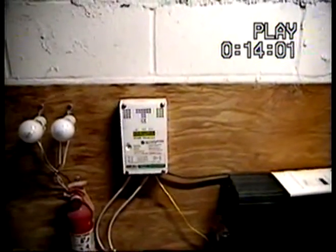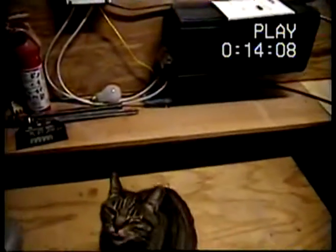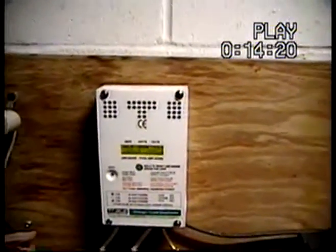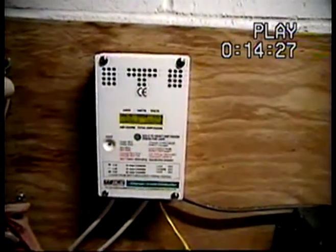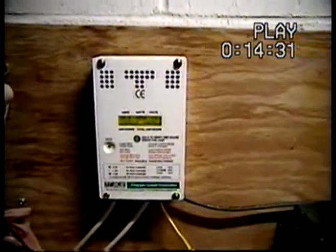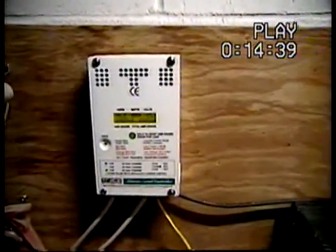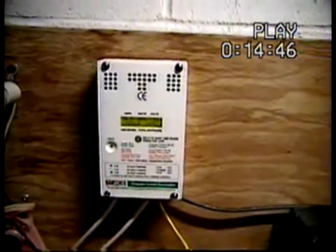It's still kind of early — around 10:30 — and we've got a lot of trees. It's wintertime, a few days after Christmas, and the trees are in the neighbor's yard so I can't really touch them. What's great about these charge controllers is they send out pulse charging to your batteries, so you don't need a desulfator — these pretty much do it for you. It's also got automatic equalization, so once a month it'll equalize all your batteries for you automatically.